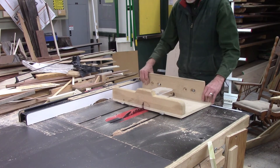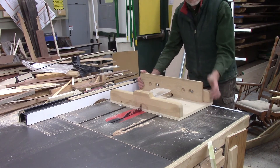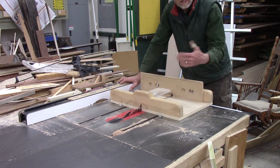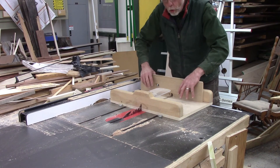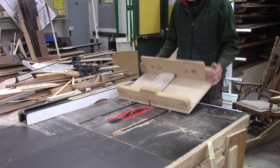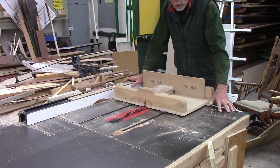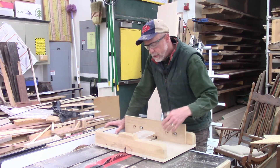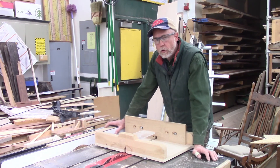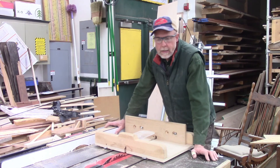One last device that's always fun to use with the table saw is known as a sled. The sled fits in the miter slots and allows me to make a nice variety of cuts — usually specialty cuts — using the table saw, maybe with a dado blade. It also allows me to introduce safety guards. Sleds can be dangerous if I'm not careful, but they can become a very important part of my woodworking. Sleds can be used at 45 degrees, make miters, box joints, finger joints, or just a really nice straight cross-cut right angle on the table saw.